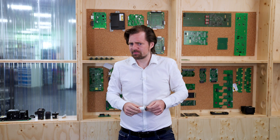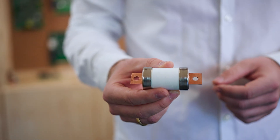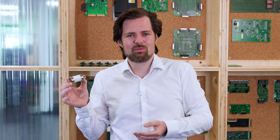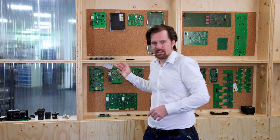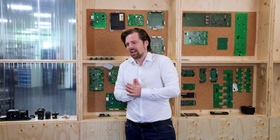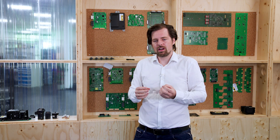What is functional safety? This fuse, for example, doesn't have electronics or software. It's a device which gets heated in a short circuit and opens — fuses from many other different applications — and there's no software or electronics that can go wrong in this fuse. However, with battery management systems and electric vehicles, there are a lot of electronics and software in these devices, and functional safety is a topic that deals with prevention of hazards that can occur due to malfunction of such electronics and software.